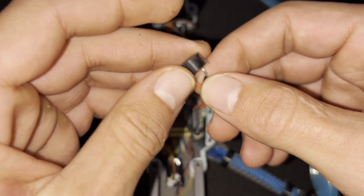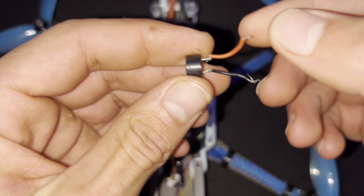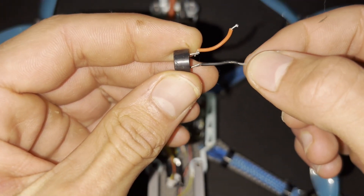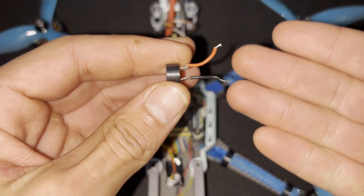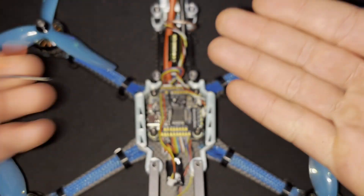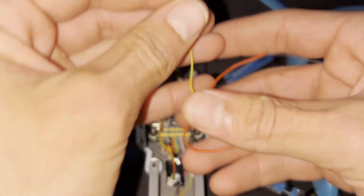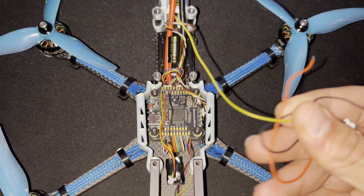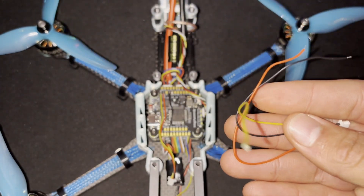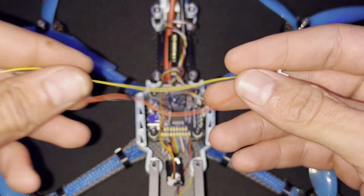From the research I've done, the BZ minus pad is where the buzzer detects that your battery has been disconnected. Conventional buzzers just have five volts and ground — no backup battery, so they can't beep when main power is lost. The finder buzzer needs that third yellow wire connected to BZ minus so it can detect power loss and trigger the backup battery to start beeping.